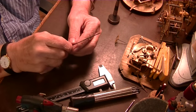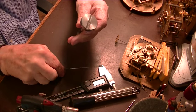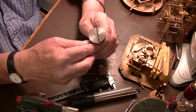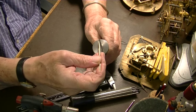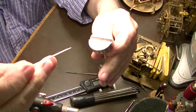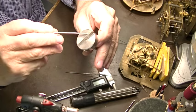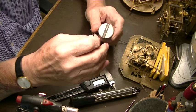Now we're going to drill a 30 thousandths hole through the end of that, and the question is how to hold it. We're going to use this tool that I made — just a Morse Taper 1 blank. I machined this off flat, turned this round, and put a 45 degree angle groove right through the very center of it, with a hole right in the very center, so when the drill goes through, it doesn't hit this — it goes into the hole.